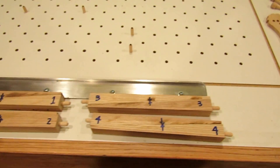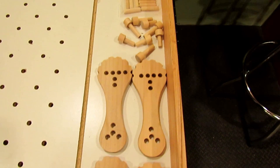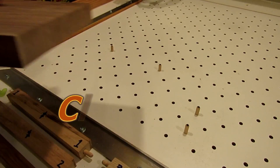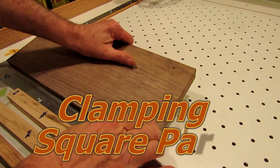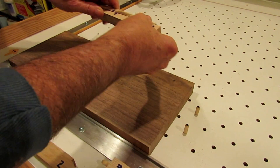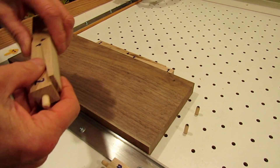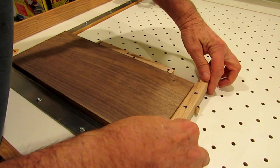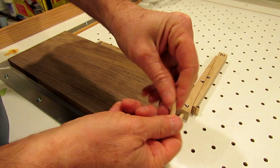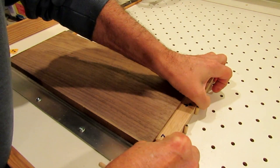The first thing I did was lay out a series of holes in the table and drill them with the router. I then cut some wedges on my table saw using a taper jig for my first set of clamps, which I use for square or rectangular parts. I put a couple of pins into holes in the top, then insert a matched pair of wedges and slide them together to get the clamping force.